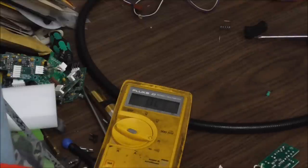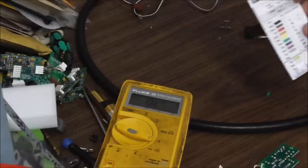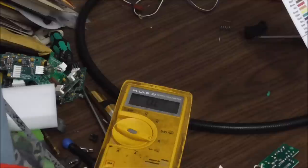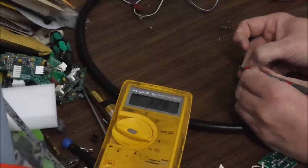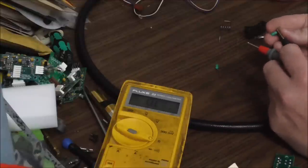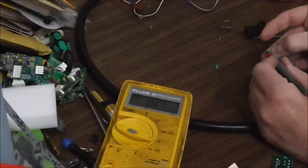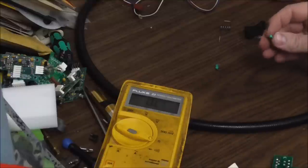It's green, blue, red. What would that be, people? My handy twistywristarcade.com chart here says, well, that ain't going to work. 5, 6... So this doesn't work. Apparently they're marked differently. Okay, so which one did we do? This one is 33, and this one is... Boy, it looks good, doesn't it? But alas, it is not. It's completely open.